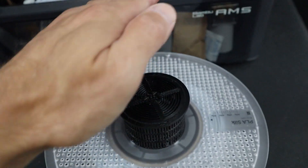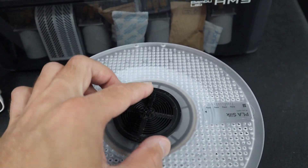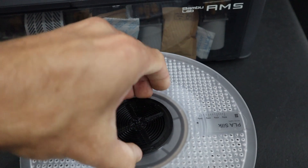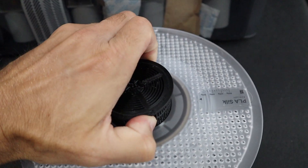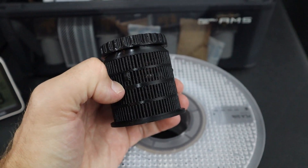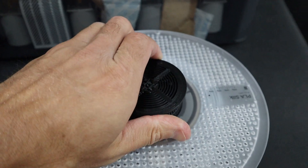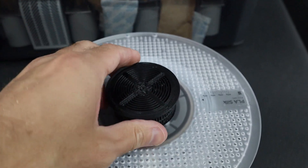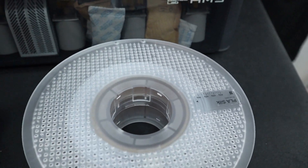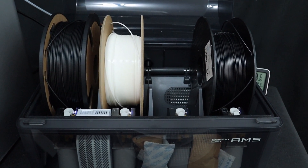One of the issues with this design is that when you snap it in, it's only exposed on the ends. Maybe that's enough, but I think we can do a little bit better. The other issue is that it's not universal — it only fits this spool. So going on the same premise, we're going to put something in the middle of the spool but with a lot more airflow, and have it be universal to fit all different types of spools.